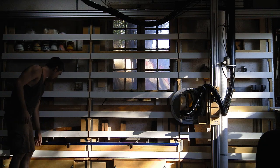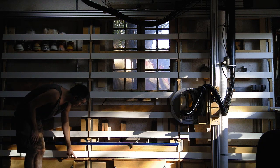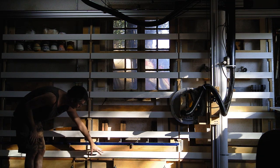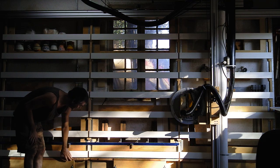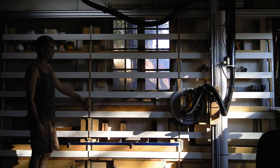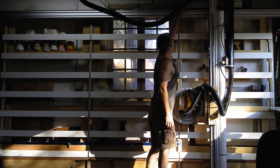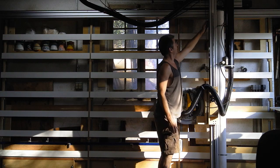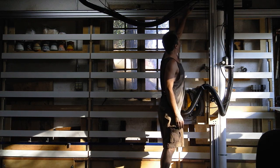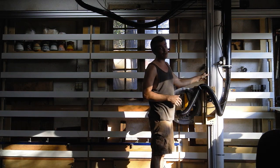The stop system was really critical — setting up the base, this doesn't look like much, it's a very unflashy part of the saw. But getting this all engineered right — the surface that your plywood rests on — is really important, because it has to be parallel to the upper rail for this to be square. These are gate wheels, and this is a metal plate that holds them in. It's adjusted square with a square, and then fine adjustment was achieved by inserting shims on this side, just to get it perfectly square. And it cuts square — it cuts really square.